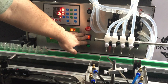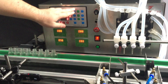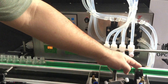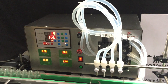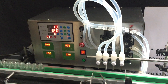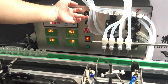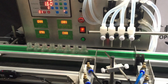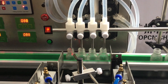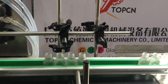Let's try again. Since I already opened the power switch, make sure the filling nozzles are open and press Auto. I need to turn on the air first. Then open the auto mode, turn on the conveyor. It will wait for four bottles, then it will start filling.